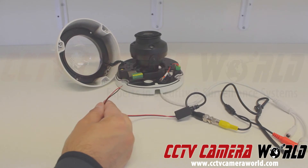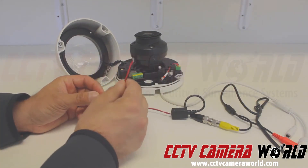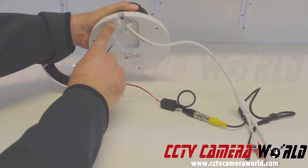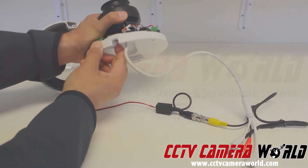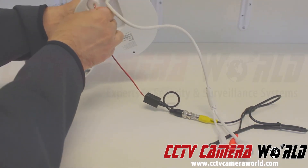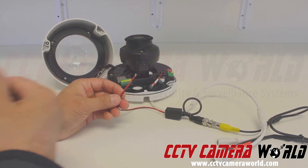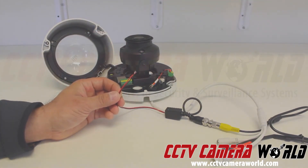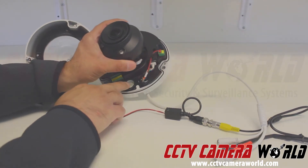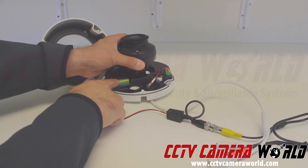If you're doing a clean installation, you want to have a longer wire. The microphone sits outside the camera and you thread this wire into the camera through the bottom. There is a grommet right here — you can actually punch a hole in there and run it through. It's a very thin wire; in my case I'm using stranded. You can actually just use two leads that you rip out of a Cat5e or Cat6 wire and put those two leads through — not the whole cable, just two small leads. Punch it using a small punch tool, thread the cable through, and connect it here.